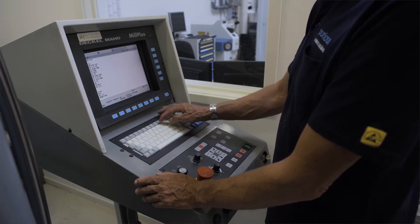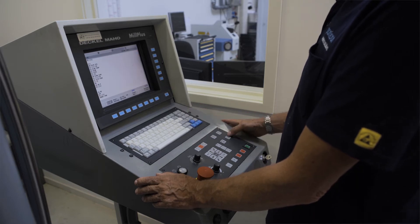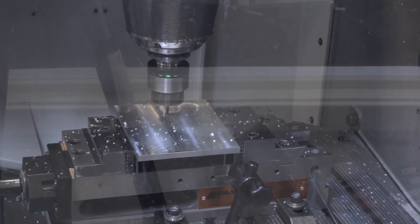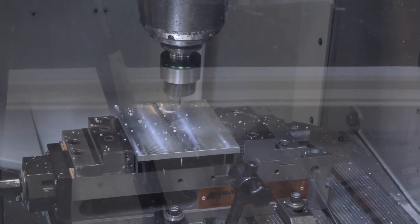After the first milling process, the Spike user can already analyze the collected data and apply his expert knowledge to optimize the production process at his own discretion. With Spike, the impact on the applied forces can be examined and verified in real time. Since you can identify and eliminate peaks in the applied forces — we call those tool shocks — you can effectively increase tool life.